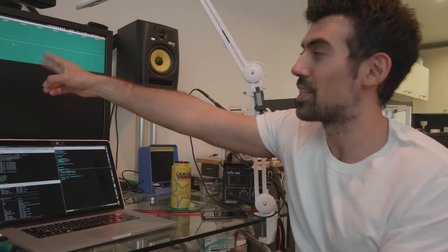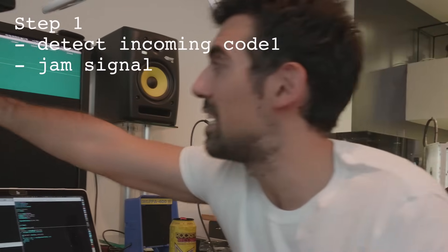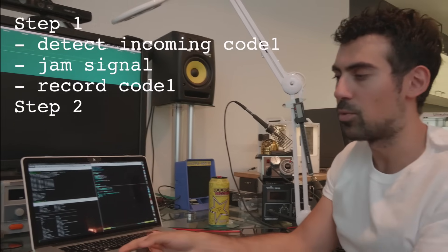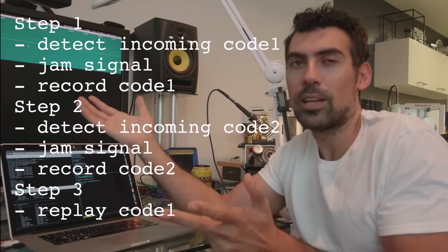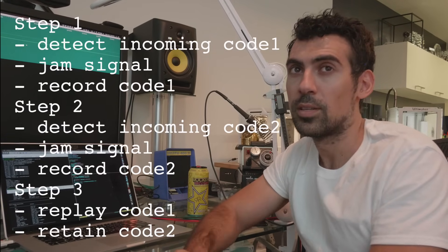So you might think this is an unhackable protocol, but Sammy has a solution for that too. What if you could actually interfere with that signal? What if you put a device on someone's garage or car, and it looked for a sync word, and whenever it saw data coming in, it would jam a frequency close to that? Your car or garage would not be able to hear the actual rolling code that your transmitter sent — and I would now record it. Then you're like, I just pressed this button and my garage didn't open, so you hit it again. You hit it two times and produce two rolling codes. I've jammed both — then I can replay the first one, and it allows your garage to open. But now I have a future code I can come back later and use. These devices have no sense of time — all they have is that sequence. So that is a big issue with rolling codes.